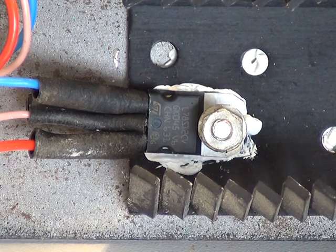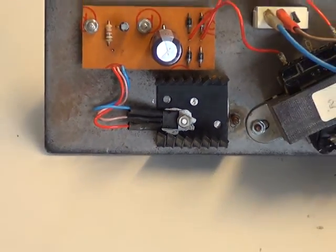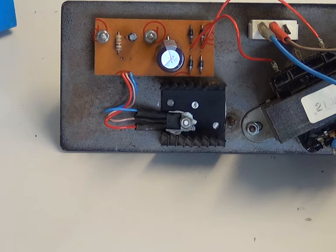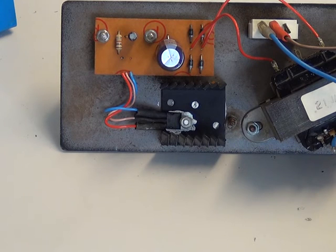Mr Chippy has now fitted the new two-amp device. We've concluded that the way the diodes are wired in that bridge rectifier arrangement should be quite OK for approaching two amps. If you wanted, you could upgrade those diodes to two-amp diodes instead of the one-amp diodes, or you could put three-amp ones in — the part numbers would be 1N5400 or 1N5401. So we've got the new capacitors in and the new device in.